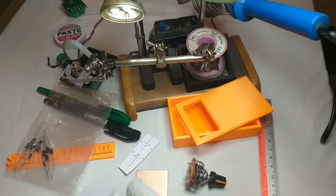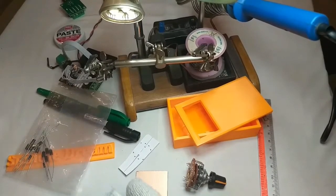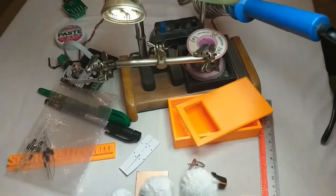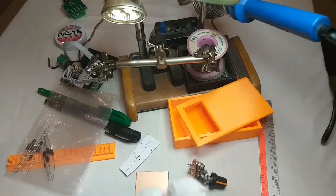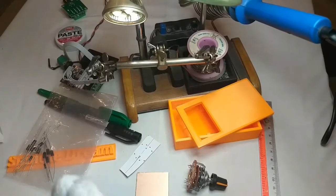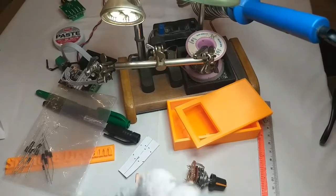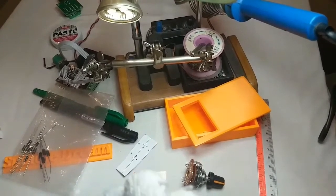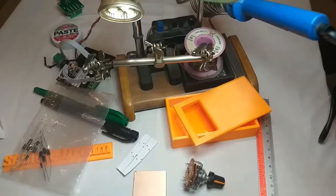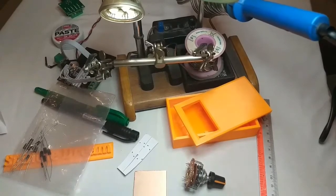I want to talk about the temperature. The temperature for the spindle, the operating spindle, needs to be between 20 to 25. But in reality, it is different, 40 to 60 centigrade. That means 68 to 77 Fahrenheit is needed for operating the spindle. And in reality, it is 104 to 140 in Fahrenheit.